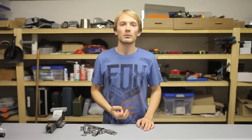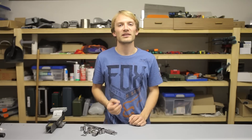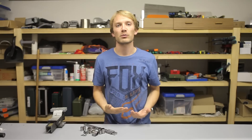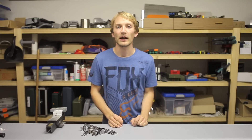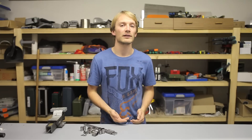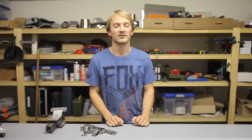To sum things up about the linear bearings: use precision shafts and keep them clean and lubricated, and you should have a very precise and reliable motion system. I've put a couple of eBay links in the description just to give you a starting point for shopping for affordable bearings. As always, thank you for watching — please share and like this video if you found it helpful, and subscribe if you want to stay updated when I upload new videos. See you next week!